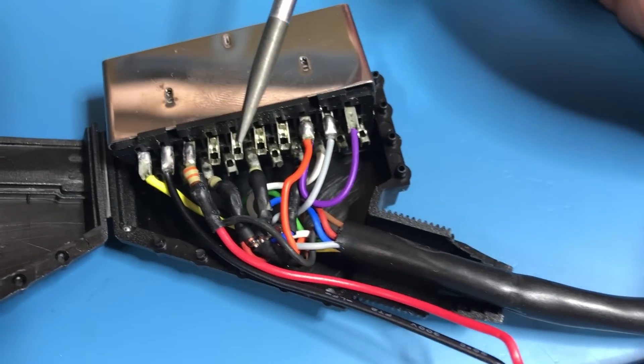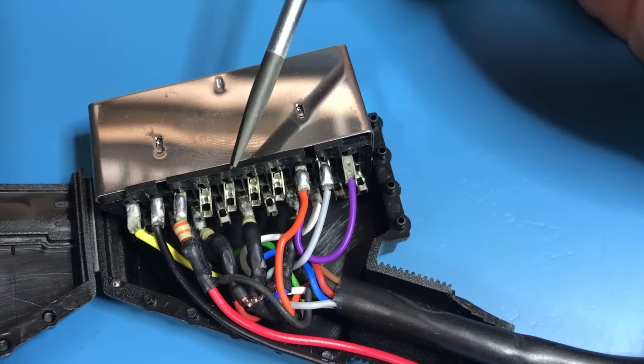Since all those formats are analog, they can't be fed directly into a digital video input like HDMI, but if the display you're thinking of using has one of those analog inputs, then you can probably just make a cable easily and cheaply. One more thing — sometimes video formats are almost compatible and can be easily adjusted when you create a cable. For example, the standard RGB video format has a voltage range for each channel, but some computers, like some late Sinclair ZX Spectrums, output voltages beyond that range. Usually that just means colors show up too bright, but you can easily fix that by adding some resistors in series with the channel to lower the voltage intensity.